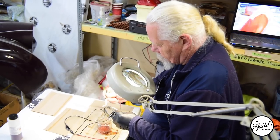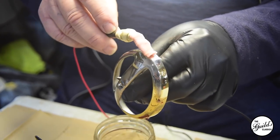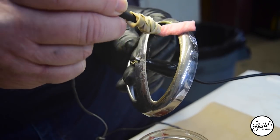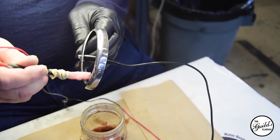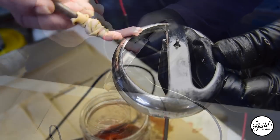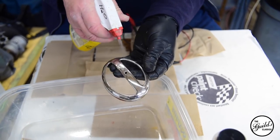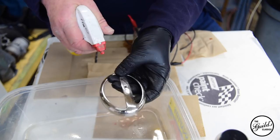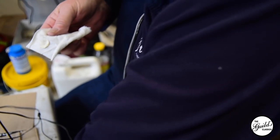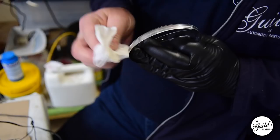If it all comes off and ends up on your wand, if you see sparkly bits on your wand it means your piece isn't clean enough to plate. Now it's a simple process: you have a wand that you apply a cotton swab to, and this gets soaked in an electrolyte which is loaded with nickel, cobalt, and a couple of other materials that make it conductive. We hook that to a power supply at about six volts and 450 milliamps, which provides the driving force to take the metal out of solution and deposit it on the piece you're working on. It's just a DC power supply, a solution of your electrolyte, your work piece, and lots of time and effort.